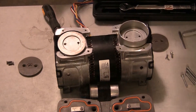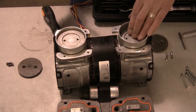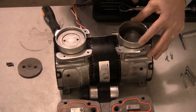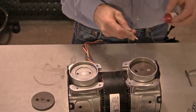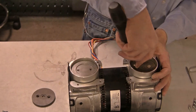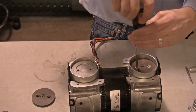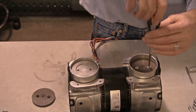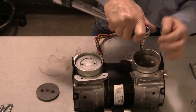Install the new piston cylinders over the pump's connecting rods. Place the new piston cup facing up inside the cylinder and install the retaining plate using the screws provided in the repair kit. Secure the screws using one drop of a low strength thread locking compound, such as Loctite 222. Securing the screws is easier if the piston rod is pushed to the bottom of its stroke so that it doesn't move when the screws are tightened. Tighten and torque the screws to 50 inch-pounds or 5.6 Newton meters.